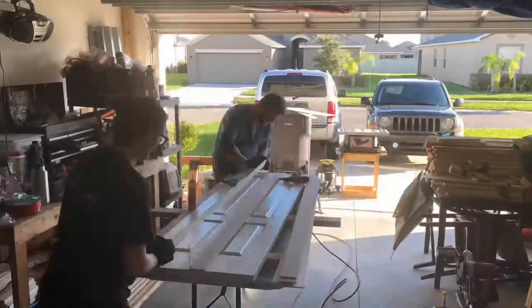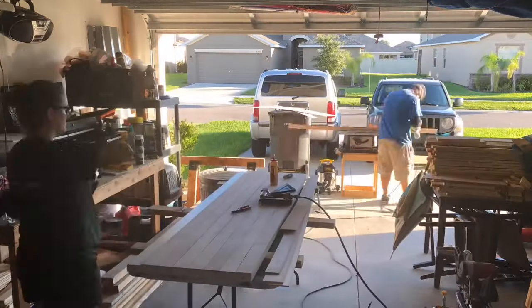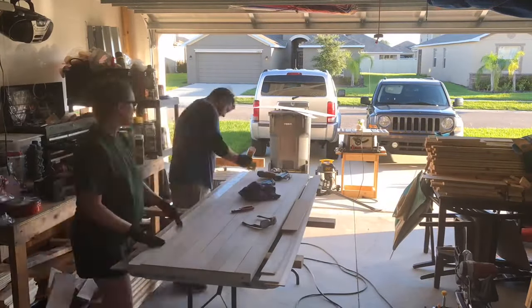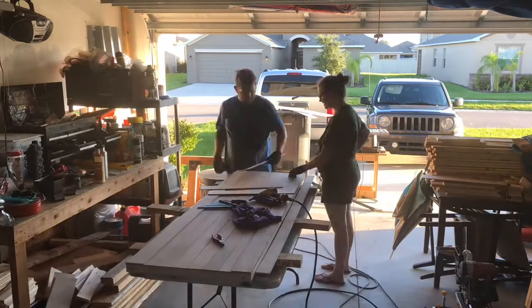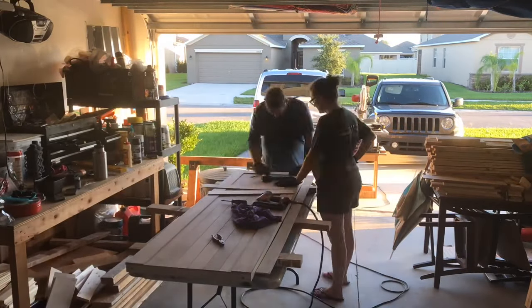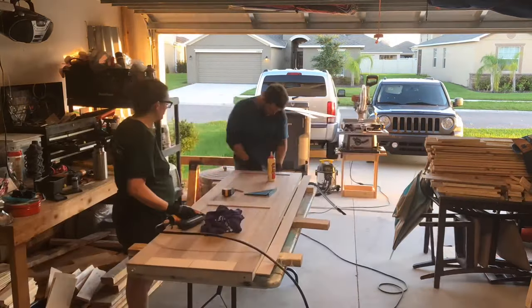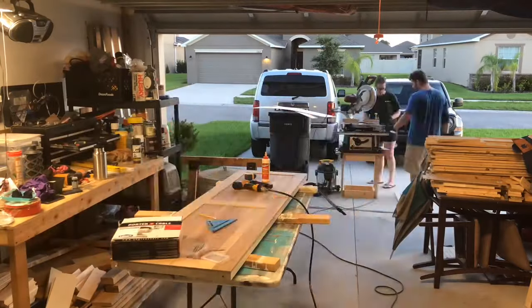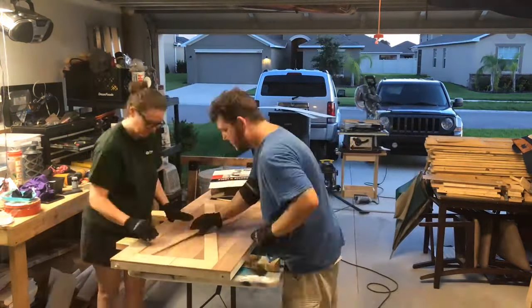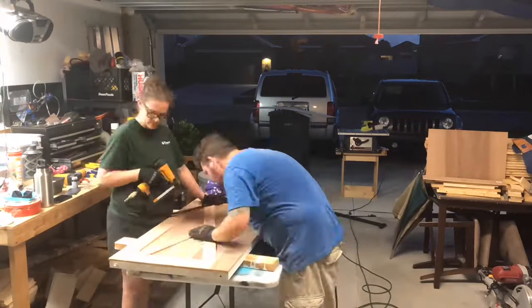Pretty simple project, pretty cool. A couple of quick tips and tricks: we took the boards ripped down on the table saw and sanded the edges round, just so they looked worn or used. Then you just glue them and brad nail them to the front of the door. Be sure to use something to space the gap where the hinges are so there's no binding when opening and closing — we used popsicle sticks, and they work great for spacing on most of our farmhouse projects.